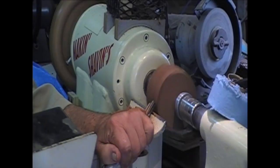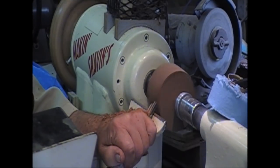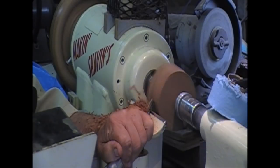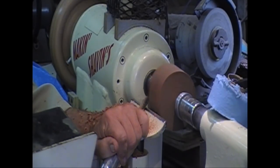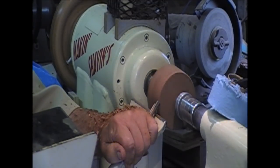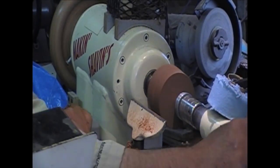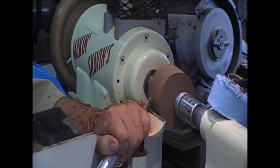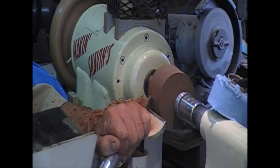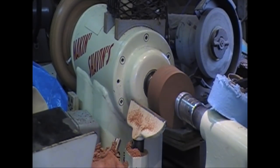Crank her up a little, probably at about 900 RPMs. Is that critical? No, it's not. Running fairly smooth between points, being held nice and tight, and I can shake this. See, when it spins like that, it means that the step center is slipping a little bit. A little more pressure on the tailstock will fix that. What also helps is right here, a special knob called speed control, and crank it up to about 1400 RPMs.